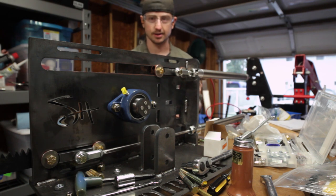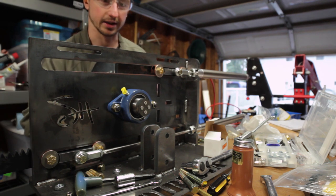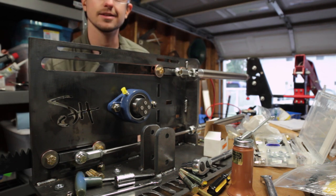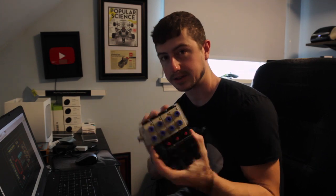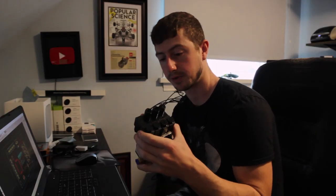Pretty much everything is together. And now I'm going to build a circuit board that's going to control everything. It's also going to control a heater that's not here yet, so I can't show you that. So let's go and design a PCB. Now that we've established that we're going to be controlling at least three solenoids — the two of them are actually going to be firing at the same time, but we have to fire both directions. So I picked up one of these pneumatic solenoid blocks from Amazon, and this is surprisingly inexpensive and you can do a lot with it. This one takes 12 volts. Some of them take AC like 110. So I know I'm going to be using this, so I need to be able to control at least four of these and maybe a heater.